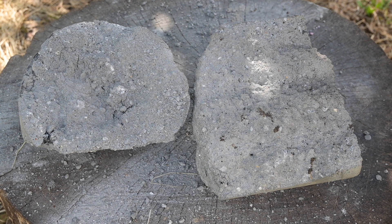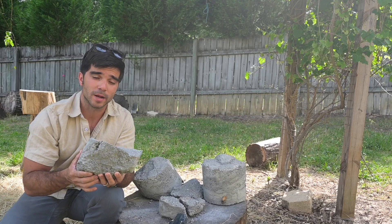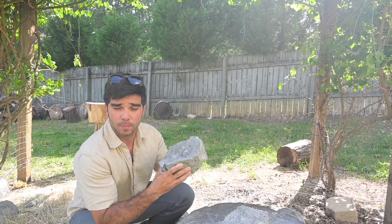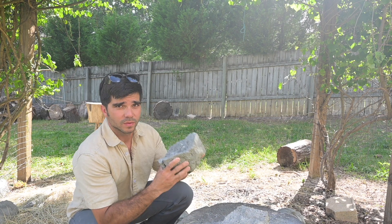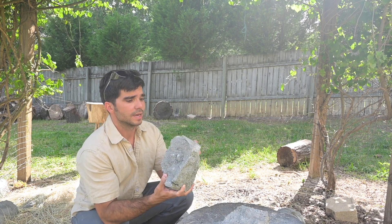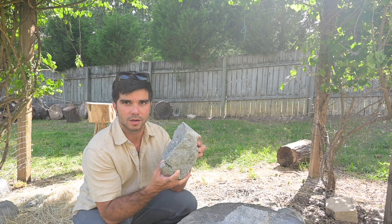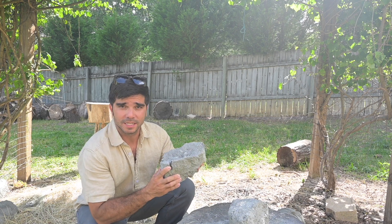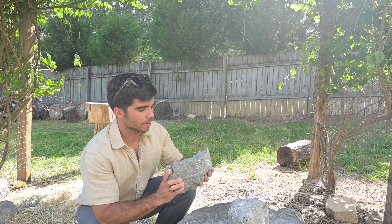That's probably not what people want to hear, but just look at the difference — air pockets, no air pockets. It seems like you guys are right: I do need to wait longer on these projects. It's still not perfectly mixed. I've been trying to test the limits of dry poured concrete simply because I don't trust it. Some folks have had very good experiences with it, others have not. The problem I have with dry poured concrete is that it doesn't really save you anything because you have to come back and water it for hours on end. I really wanted this to work because I have some projects in mind. If you guys have some ideas on how we can test dry poured concrete some more, make sure to leave a comment below. Thanks for watching!